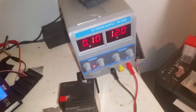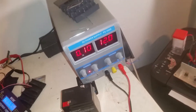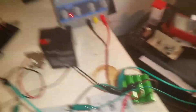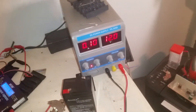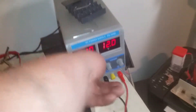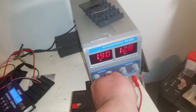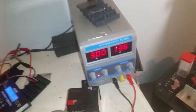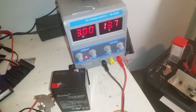They went from being not quite open circuit — going straight up into high voltages — down to 12V. I'm only putting in 100mA at the moment, so I'll let it off a bit. Push to 3A; they should slowly start taking some charge.